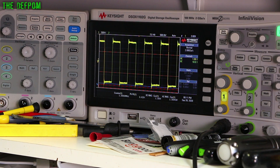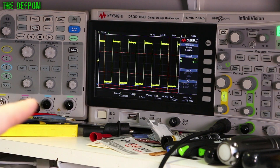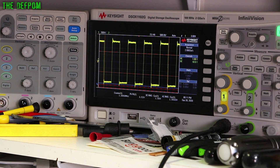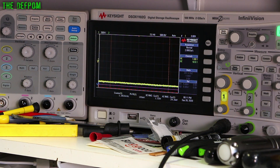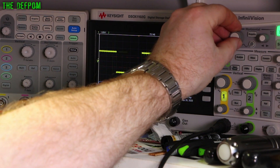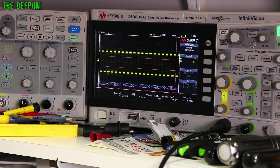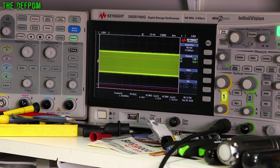Square wave's looking a bit yeah - look at that, oh that transition's pretty bad. But it's probably because I'm using this cable and it's picking up a bit of noise and ringing. So don't worry about it too much, it's not great probing. It also has modulation sweep - so AM modulation, that's sweeping. We can see it on here. So that is sweeping from 1kHz to 2kHz modulation, and that's carrier wave - so that's straight modulation. That's FM instead.